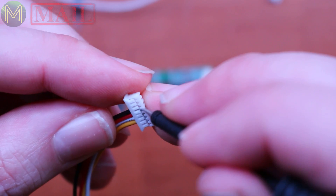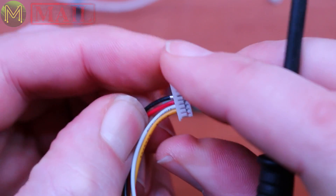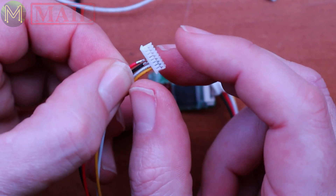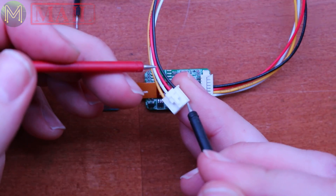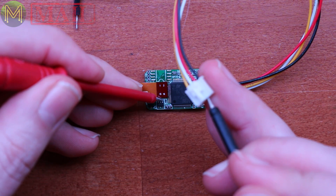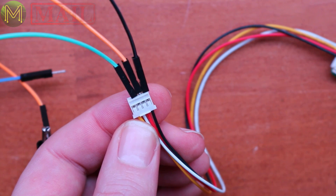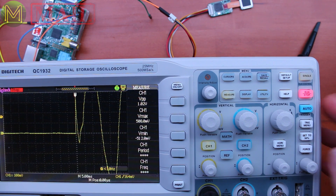You've just got to get in underneath the little tab and pull it out. It sort of comes out eventually. I want to reverse these pins around completely and they should just slot back in again without too much trouble. It's always good to just double-check everything. If this is the TX, I should be able to see some sort of response coming out of this oscilloscope. I'll set it to single shot mode so I can capture any rising and falling edges, just to see if there's anything coming out from anywhere.